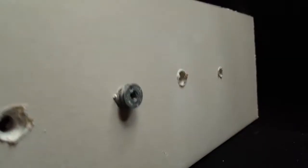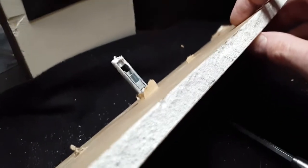Similar to the easy anchor, this is the easy toggle, where you don't need a pilot hole, although I recommend making some kind of mark, or else you risk moving it around and it won't be exactly where you want it to go. So make at least a mark with an awl or screw, or preferably even a small pilot hole.